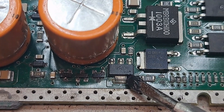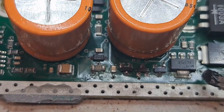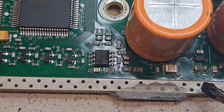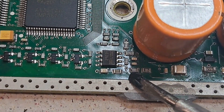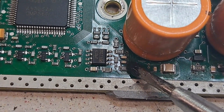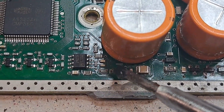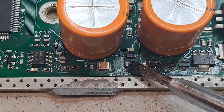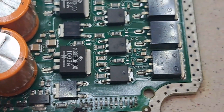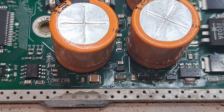That one's bad but I'm pretty sure there'll still be some pad there — I'll take that off later and check. That one's a bad one so it'll have to come off and get replaced with a new one. That component there will also need replacing — it usually handles the cranking. That and other areas of the board. Normally on a no-crank that's one of the issues, and with it being as bad as it is, that's why I suspect the MOSFET might be blown as well. I'll replace them all out and see if we can get the board working.